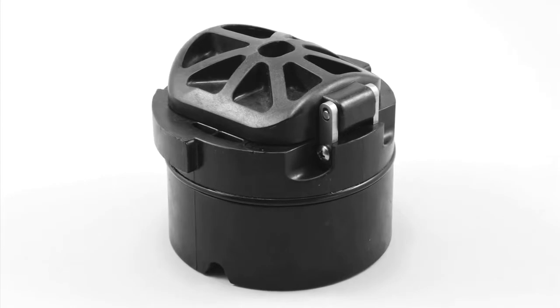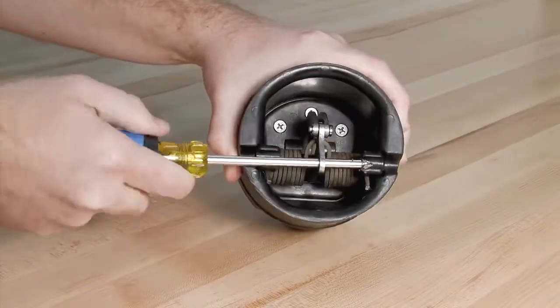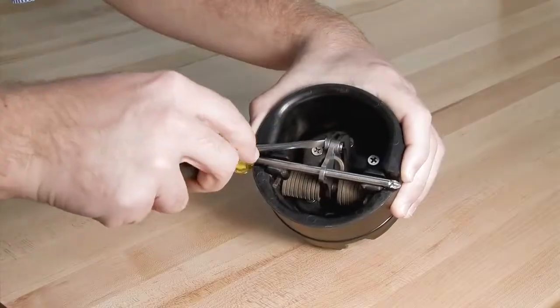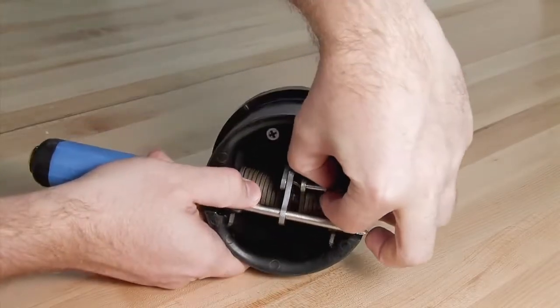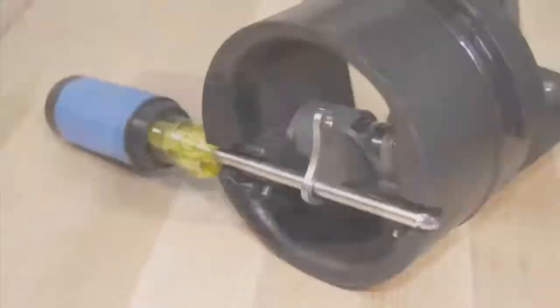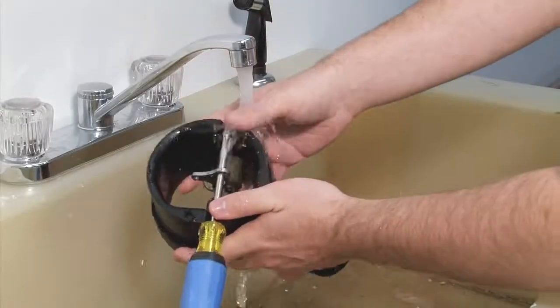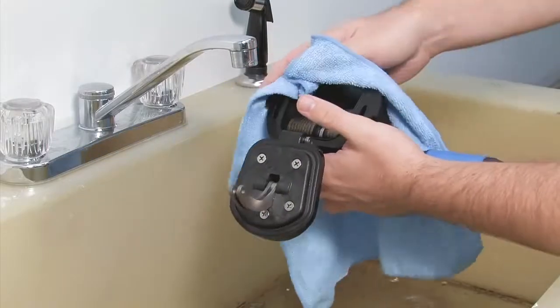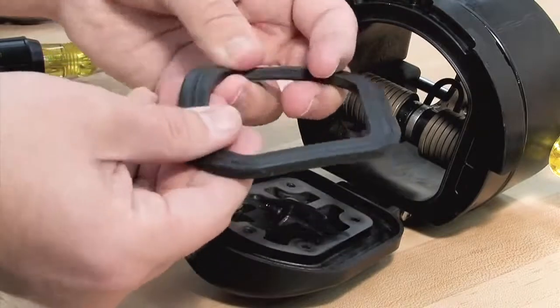To open and inspect the checks found in the 2½, 3, and 4-inch assemblies, begin by placing a number 3 Phillips head screwdriver through the service notches found on either side of the check and the hole in the cam arm to pick up the check tension. Carefully remove the E-clip using a flat blade screwdriver and remove the pin. The check clapper will open with no tension. With the E-clip and pin disconnected, never remove the screwdriver — doing so could seriously harm yourself or damage the check. Begin your inspection by cleaning the check with water to remove any dirt or debris. Damage or deeply embedded debris may be invisible to the naked eye and can only be detected by close examination and touch.